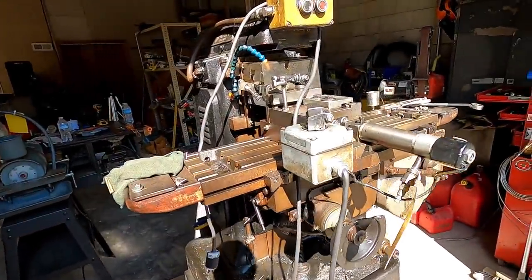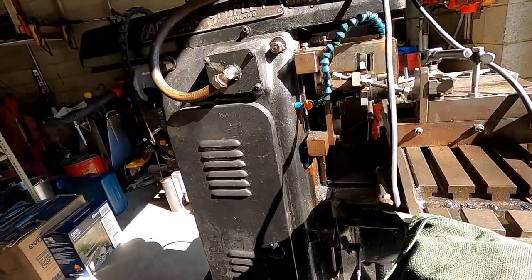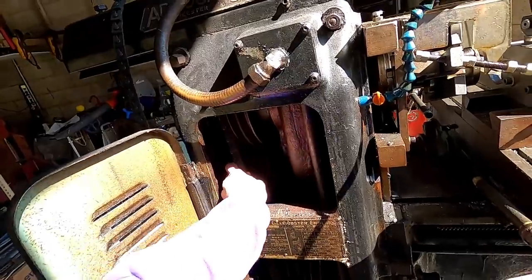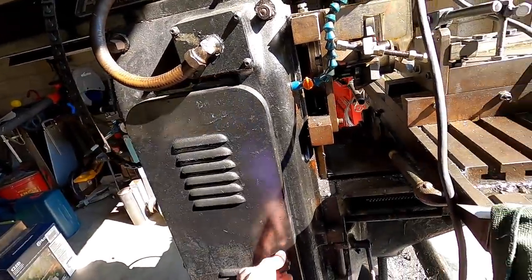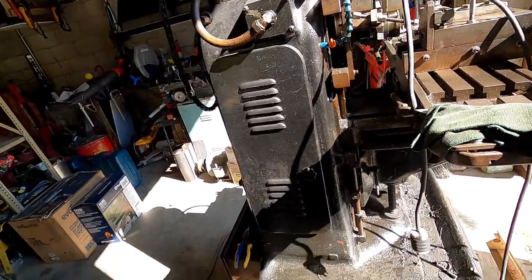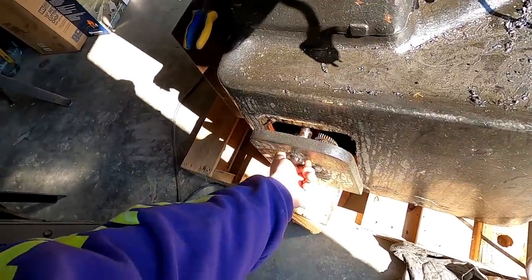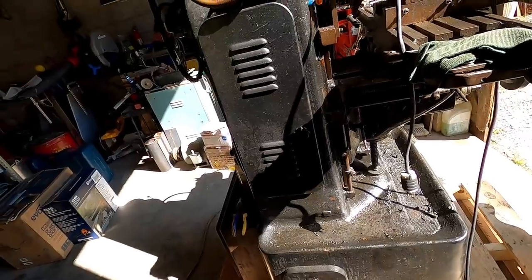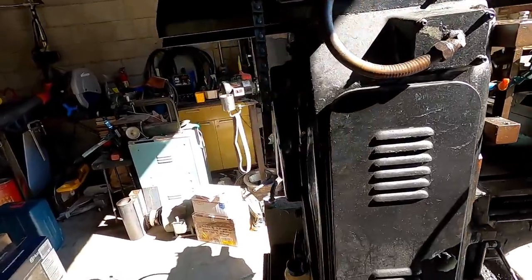I haven't seen anything that concerns me at all on it, as far as wear, just for a quick look over anyway. It is a belt-driven spindle. Everything seems extremely smooth on it. So we'll see. All the change gears for the table, as far as its movement back and forth, appear to be all here, so that's a good thing as well. All the casting on this thing is extremely thick, surprisingly thick for the size milling machine this is.